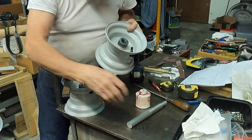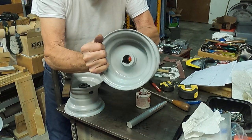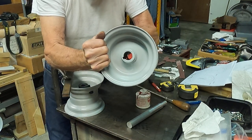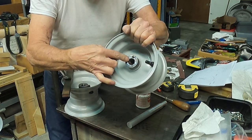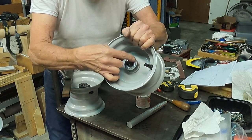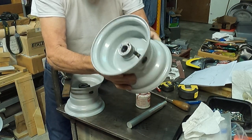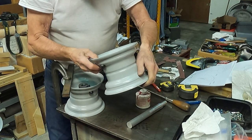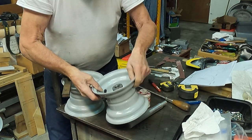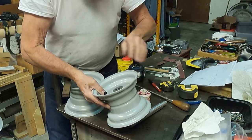What I've done — and what I've seen other people do on go-karts — is take the one-inch bore wheel, make a reducer to go in there, and then weld the reducer into the hub. That's fine and dandy, but the two of them need to be concentric — they have to line up.